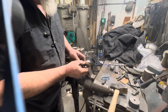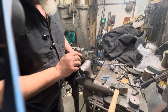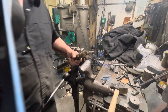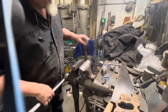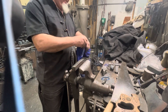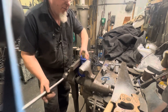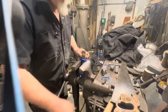So the hammer handle is still in good shape. It's just shrunk enough that I'm going to cut through with a handsaw to the bottom of my wedge slot and put a new one in. There are a lot of nearly new right-hand gloves in the shop, so I'm going to use that to protect the wood while I work on it in the vise. I could probably get away with just clamping it, but I don't want to put any fractures into the wood that may come back to haunt me later.